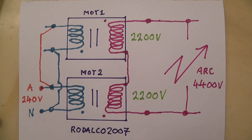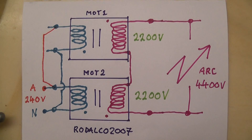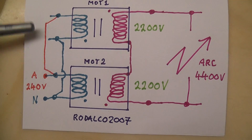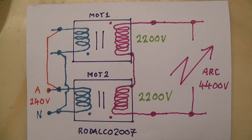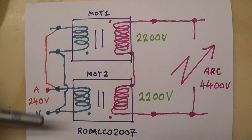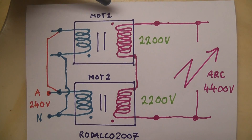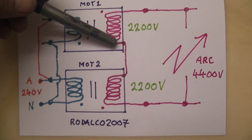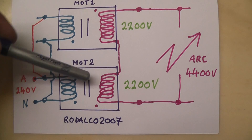Here we have the connection schematic attached upon request from some of my subscribers. 240 volts in — active, neutral, primary. The coils could be 120V to whatever your country uses. The polarity of both primary coils are in phase. The other ones go opposite. Usually the HV winding on an MOT — one terminal comes out, and the other one is spot-welded to the steel framing, so basically you don't put these two together.